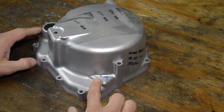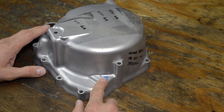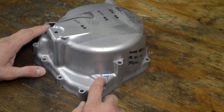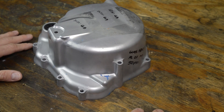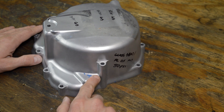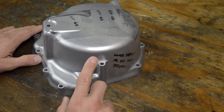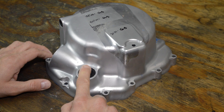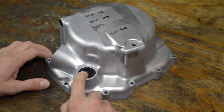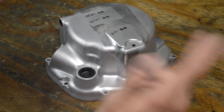Over the years, all kinds of people work on these bikes. This guy seemed to get silicone everywhere but the mating surfaces that seal — there was blue silicone all over the place, on the engine cases, on the covers. One thing I want to point out is that the vapor blaster does not do a good job of removing silicone, so it is important to clean all that off prior to blasting. As for the seals, it doesn't seem to damage them, but you're going to want to remove them anyway. Anytime you're doing a rebuild, remove the seals, blast the part, then install new stuff.